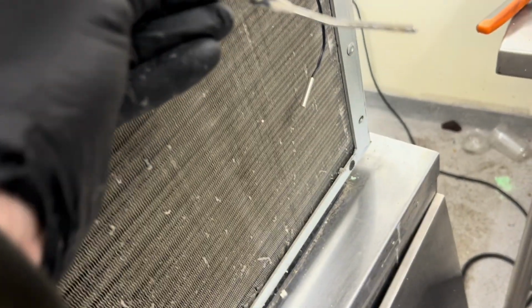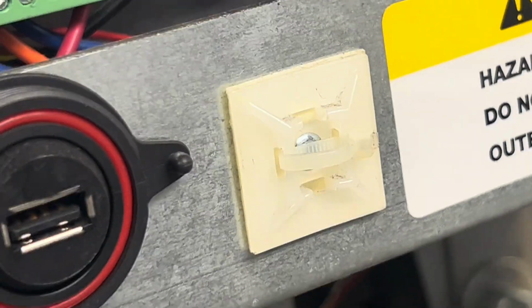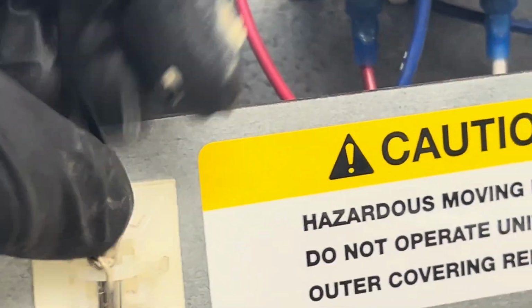All right, so the temperature probe, the original one is here, okay? And it's strapped to that line. So I need to clean this line off. This was the ambient probe that was here, right there. So I've rewired it. So the ambient probe has just become the barrel probe. And my probe is gonna come down here and lock in as the ambient.